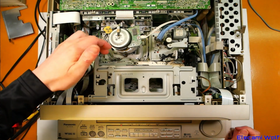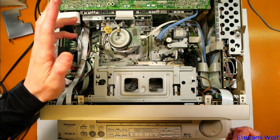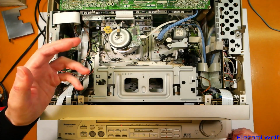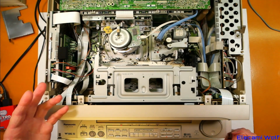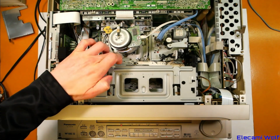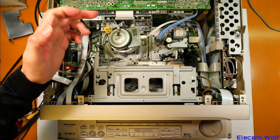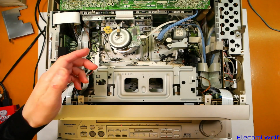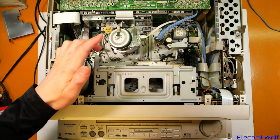The peg that drives the loading arms would pop off of the control plate and everything would get stuck. That happened repeatedly, and I couldn't work out why. Suspecting that the back tension arm was getting stuck out there and banging into them, but reviewing the video I took, that was obviously not happening, because I could see the point that the mechanism popped out of alignment